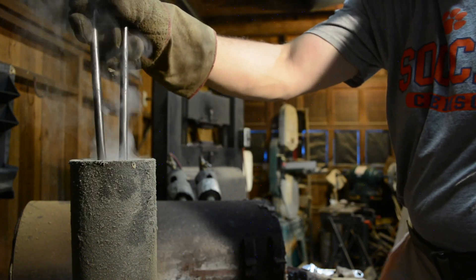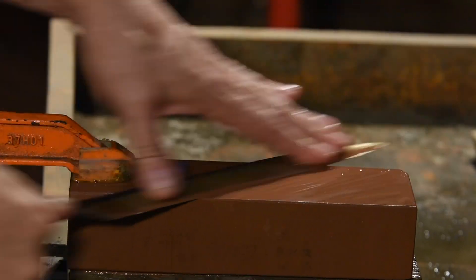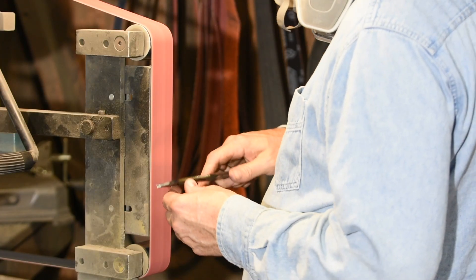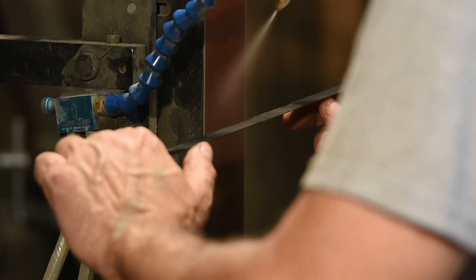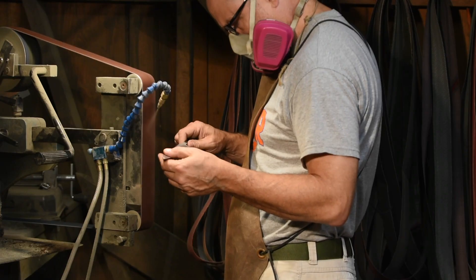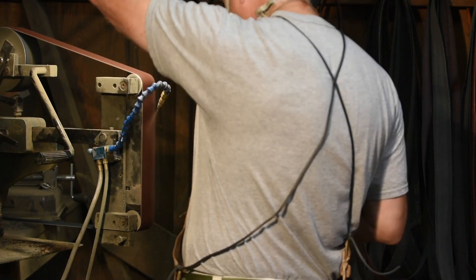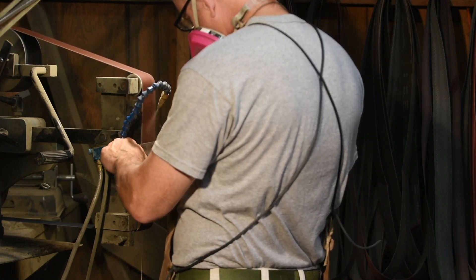What does that mean? You have to finish it on a hand stone? No — but you do have to be patient, go slow, and keep dunking that blade in your water bucket. I've got a cool mist system. I used it a lot when I first got it, but it's very messy so I don't use it on every knife. But for thin blades like Scandis, it can be very helpful. If you make a lot of Scandis, this kind of system might be very useful to you.